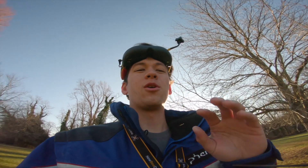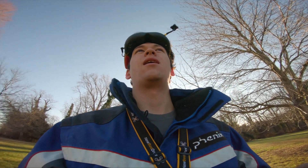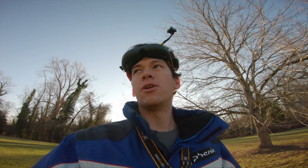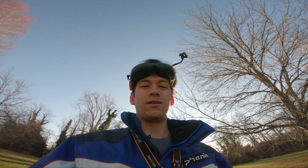All right, so that was a little more P on both axes and then a little more I on both axes. And I think it's pretty dialed on pitch and roll now. So the only thing left is yaw, and yaw is pretty close. I think just a little more P on that and it's going to be good. So I'm going to dial that in and we'll fly again.